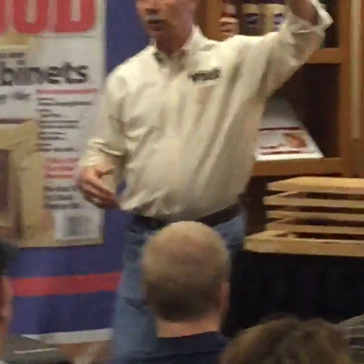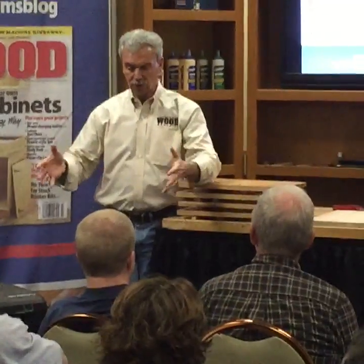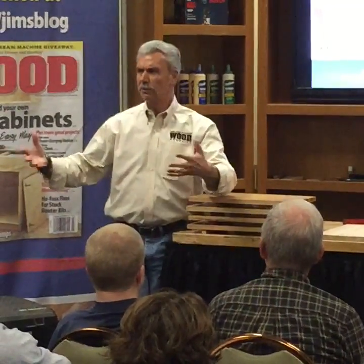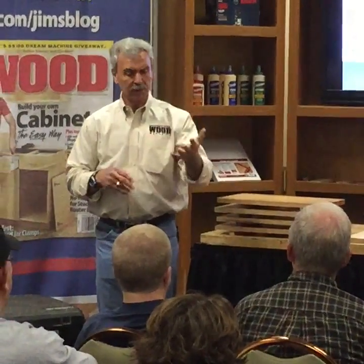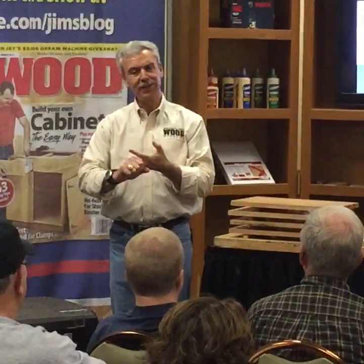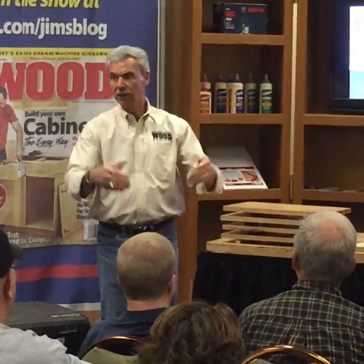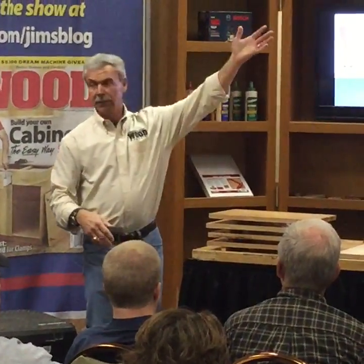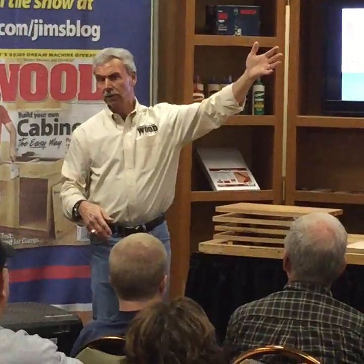My shop is on the 2nd floor of my barn behind my home. I have a 1st floor where the kids had their chickens and sheep when they were little, and the stalls in there are where I store my lumber. I don't heat that or air condition it, and during the summertime, the temperature and humidity are 90, and during the wintertime, the temperature and humidity are 0. So the wood is fatter during the summer than it is in the winter, just taking in and giving off moisture forever. And in my shop on the 2nd floor, I heat that, though I don't air condition it, so the humidity is different up there too.